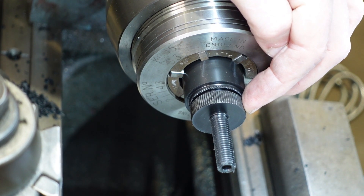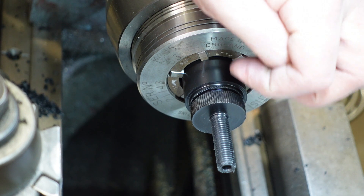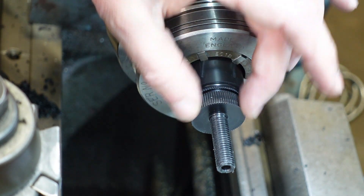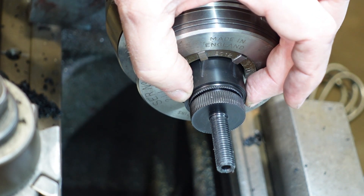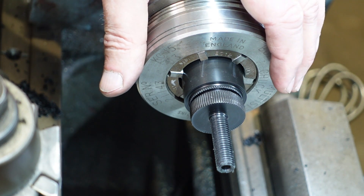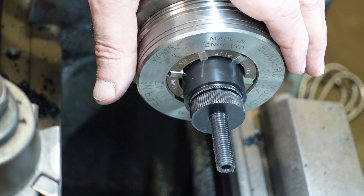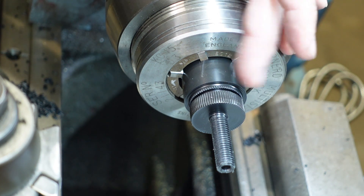We just put a knurl on this bit of plastic and as you can see that works quite nicely. However, one thing I couldn't work out for a moment was why the knurl kept feeding that way without any feed engaged — and it's another thing that plastics will do. You can just see a scuff mark there: the plastic was walking its way out of the chuck because of the forces applied. You need to be mindful that plastics will tend to move on you. You can't clamp too hard or you'll distort the material, but if you don't clamp firmly enough it may move on you.